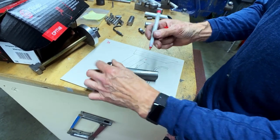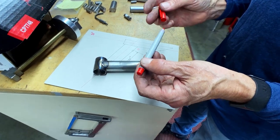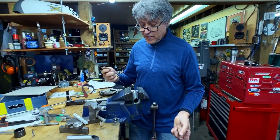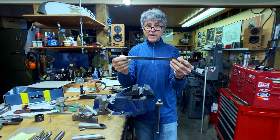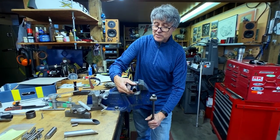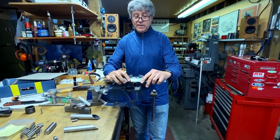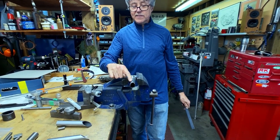So this little trick — how do you know where to mark this? Where is the very top of the tube? Well, it was something I used to ask my students in frame building 101: how do you mark the top of the tube using only a ruler, no measuring, no felt pen, nothing? They would scratch their heads for a while; occasionally one student would figure it out, but most of them I had to show them. You take the ruler, hold it level out at 45 degrees, and you just pull. And that is the top of the tube.